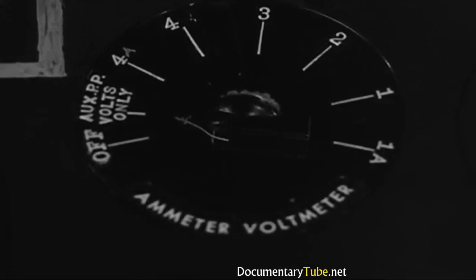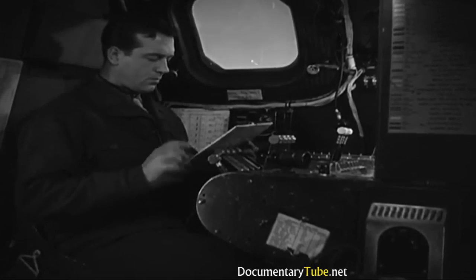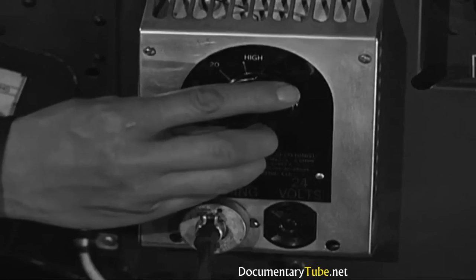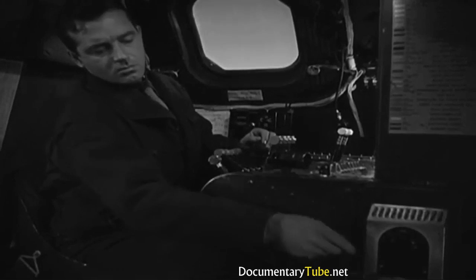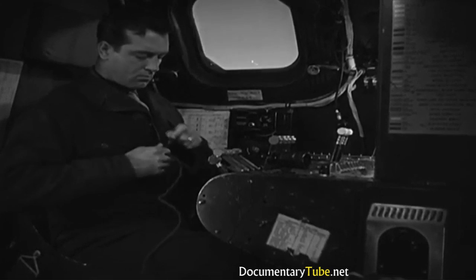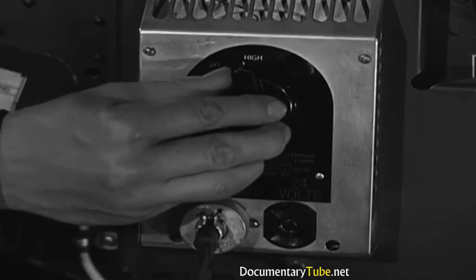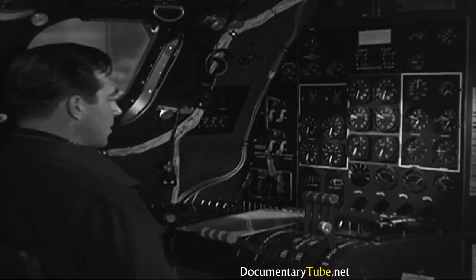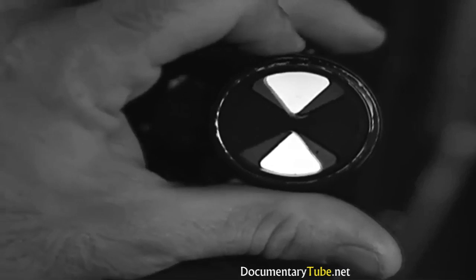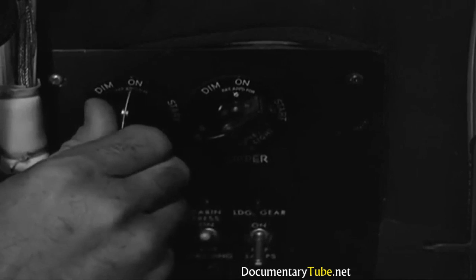Selector switch set, voltage 28. And now what's on the checklist? Well, there's current available, so I can try out my heated flying suit. Have to turn the rheostat off before plugging in. Now to get connected up. Just slip this one jack into the socket, then twist the rheostat all the way to maximum. I should begin to cook pretty soon. While I'm waiting for the suit to warm up, I might as well check the fluorescent lights. Turn it on, twist the lens, and there you are. 2 more of them over on the left. Turn the switches on and look at the bulbs.